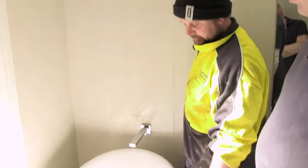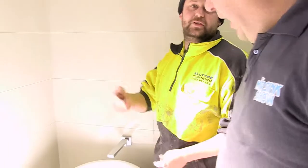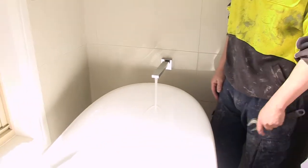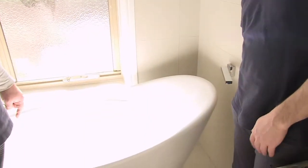Before we turn the water on, you always want to take your filter out. What happens is, as you cut the pipe and cut the nipple sticking through, you get little offcuts of brass. Also when you've roughed it in, any dirt that's got into the pipes — it could have been sitting there four to six months. So we're basically flushing everything out and at the same time checking for leaks. Make sure it's all nice and clean before you put the filter back on. Just one small thing to remember: before you turn the tap on, make sure the spout is facing inside the bath — not outside, unless you want to fill up a bucket.